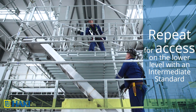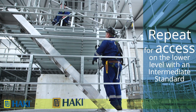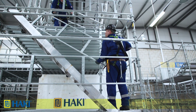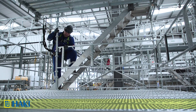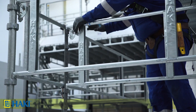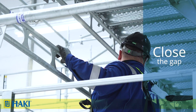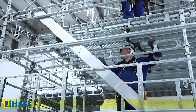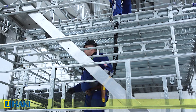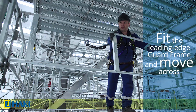This time, instead of putting a punching unit and a standard, we put an intermediate standard fitted between the upper ledger and the lower ledger. Then, as above, using a double rider we fit a guard rail between the double rider and the intermediate standard. To close the gap, we fit a ledger beam to the side and a BRS on top of it. Between the BRS and the intermediate standard we fit a ledger beam.